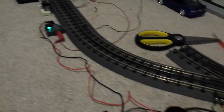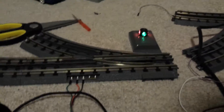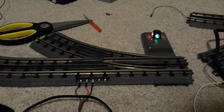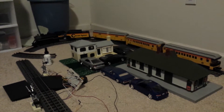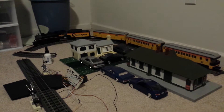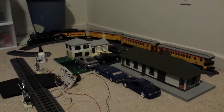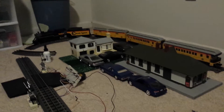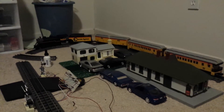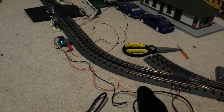As you can see when we switch there's flickering going on, and doing that multiple times on one AC source can cause overload and clipping in the waveforms, which will result in engines stopping or slowing down. It may also act as a DC pulse, and unfortunately these engines use DC pulsing to trigger sound characteristics — things like passenger station calls, horns, whistles, bells — all triggered through DC pulsing based on frequency, spacing, and possibly hexadecimal values. So accidentally creating a DC pulse is why you see the lights flicker.